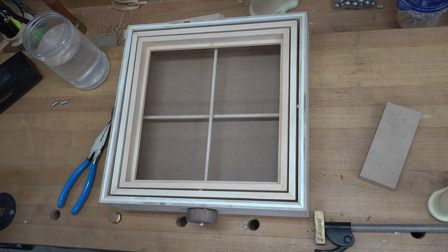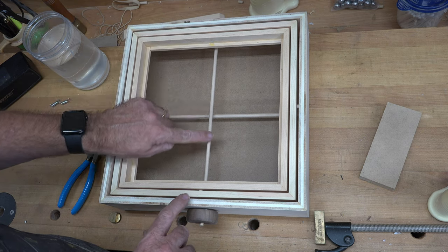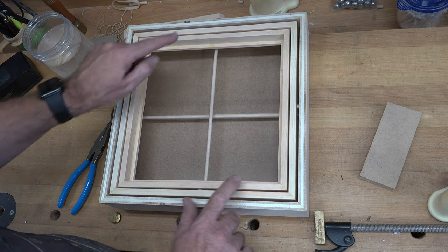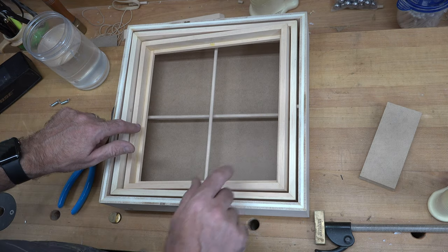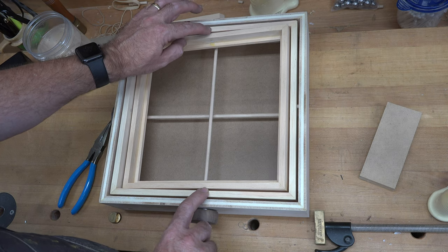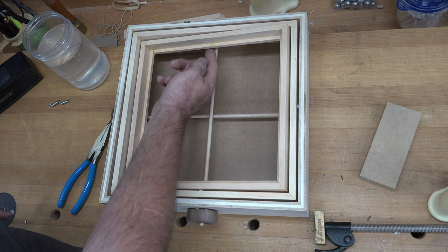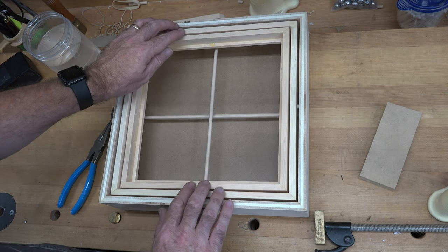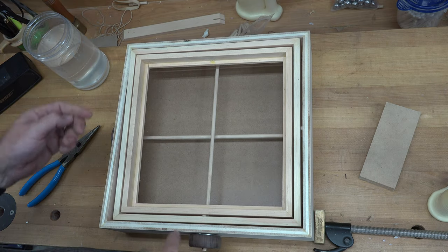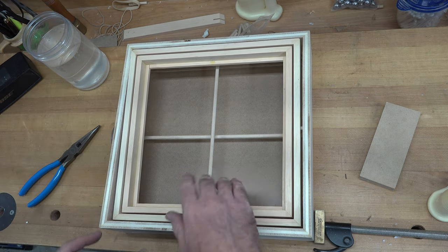On this show whenever I make a mistake I own it. Those eye bolts that I placed in the middle are interfering with my control dowels. Although it's fine on one side where the dowel is much lower, on the other side the eye bolts hit the dowel and prevent me from getting much action on that tilt. So I'm going to remove those eye bolts and shift them over to just outside of where this dowel is to give me a little more pivot action. With that fixed up, you can see we have a lot more action in that direction — I'm a lot happier with that.